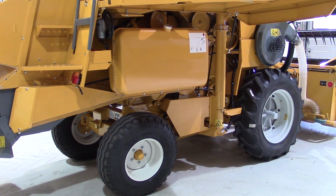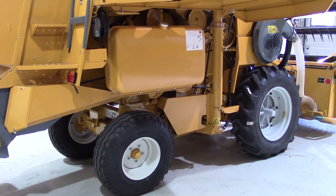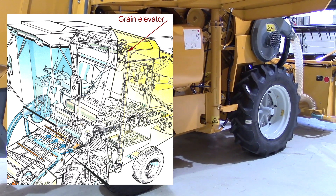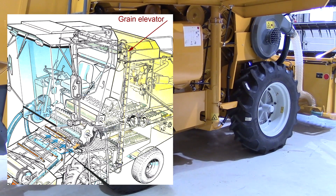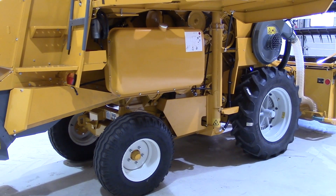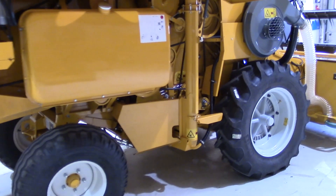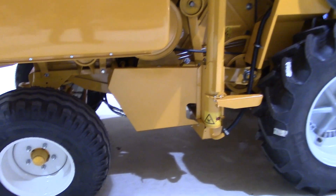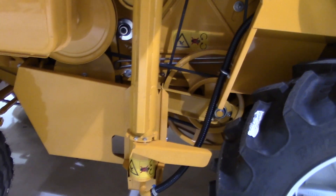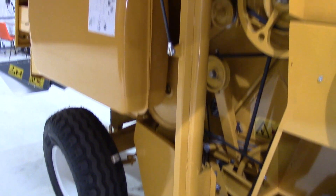There is a good grain elevator pipe which goes in a square around the combine. Inside the pipe there is a plastic pad which keeps all corners rounded, so there are no pockets left for intermixing of grain. There is also an airstream going through it, as I showed earlier, to minimize intermixing between plots.